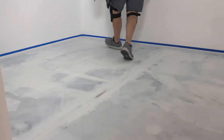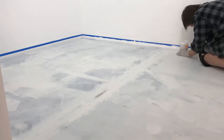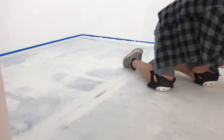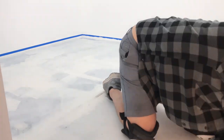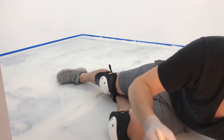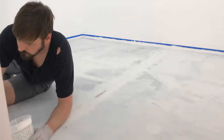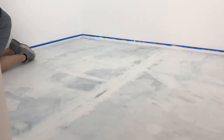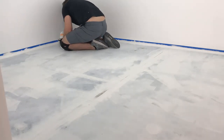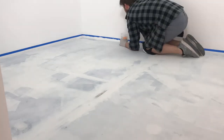I'm going to do a two-day installation here. According to the data sheet they want you to mix the full amount, but I mixed a small amount — less than a pint — and cut in my edges. I didn't do this on the shop installation I had previously done, and it was a mistake because the epoxy sort of curls off at the baseboards. I didn't want that since I'm doing this for water sealant purposes. I did about a two- or three-inch cut-in on the edge, using it as a caulk to come up the baseboard a little, then waited 24 hours.